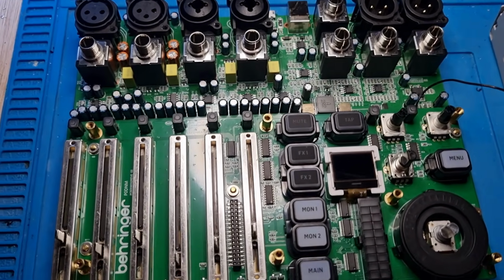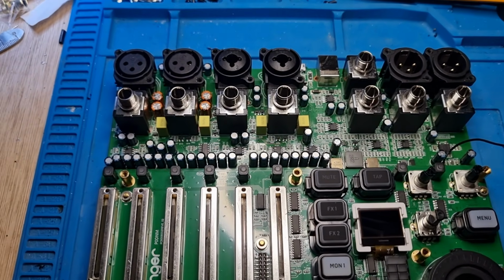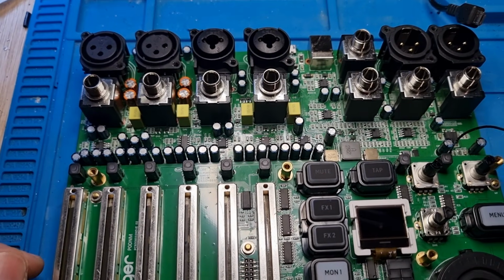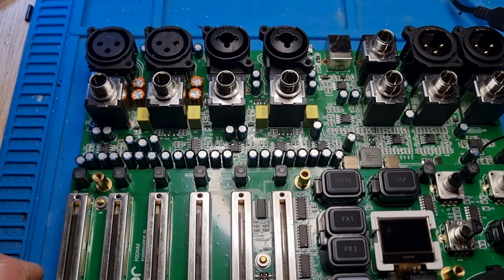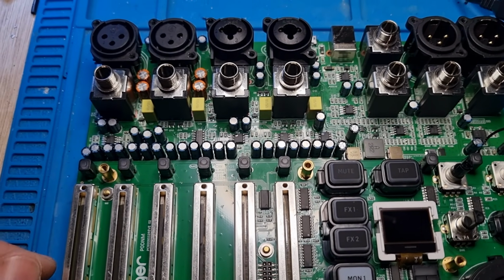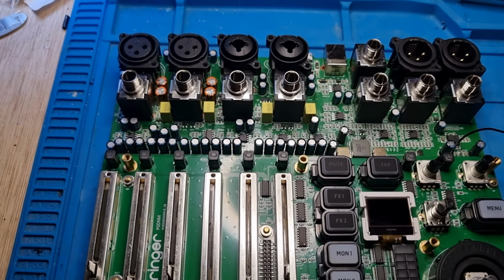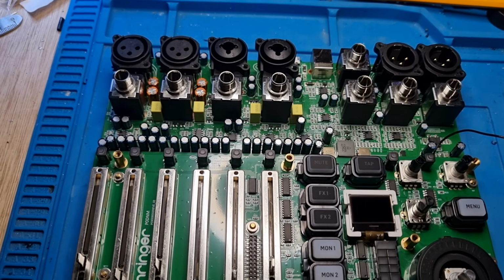Well, this is a turn up for the books, my friends. I used the customer's power pack with appropriate USB-B on the end, plugged it in, and guess what? Nothing. And then I thought, just out of curiosity, I'll do what he said he was doing and lean the connector down very slightly, and lo and behold, it springs into life. And then I plug in my own lead from my own power source, and it works perfectly.